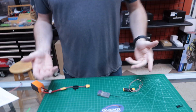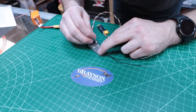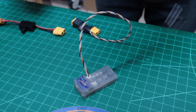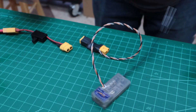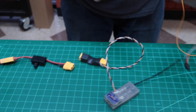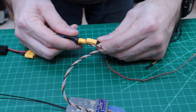So we're going to set up the 7-channel here just to show you guys. I bound one earlier. We're going to go ahead and plug in the telemetry port, and I'm going to use the current sensor — not just the voltage — so it gives a little more data for the screen. And then I need my speed control; it's just a clunky old one I've been using and testing for years.